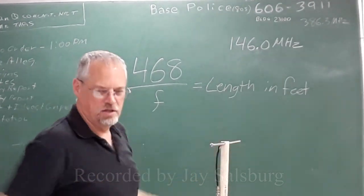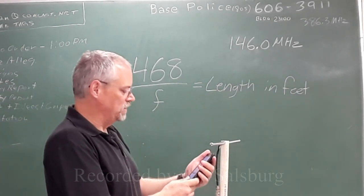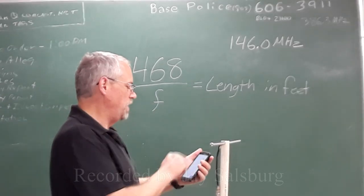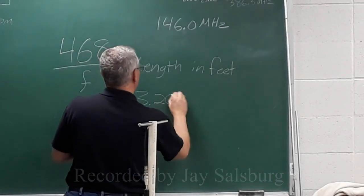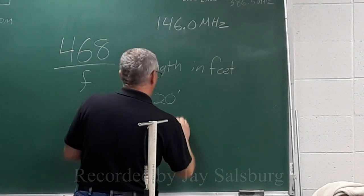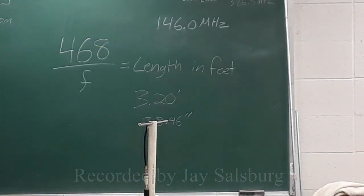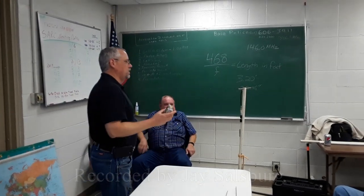All right, so let's just do it. 468, get out your calculators, because this is, you know, for fun, right? So, 468 divided by 146 equals 3.20 feet. So I'm going to times 12. That gives me 38.46 inches. 38.5. Close. Exactly. Divided by 2, each element. Well, by 4 for each element.